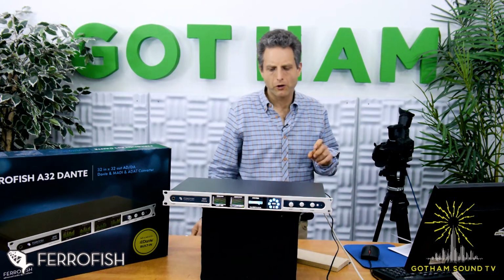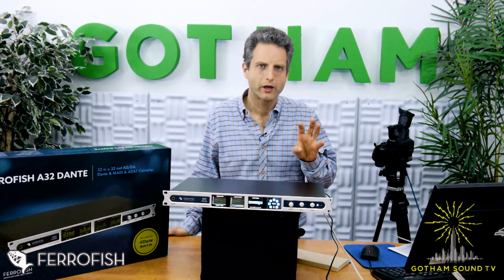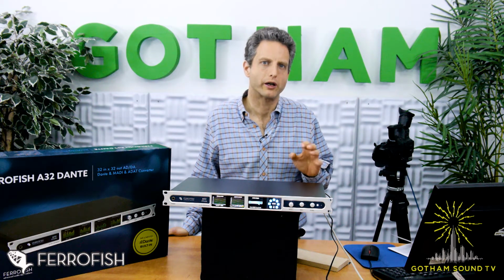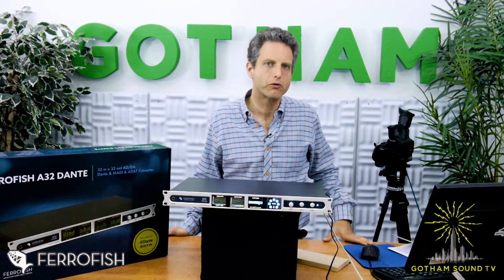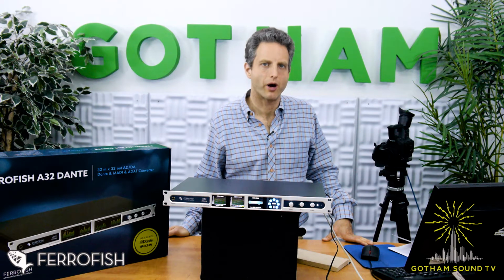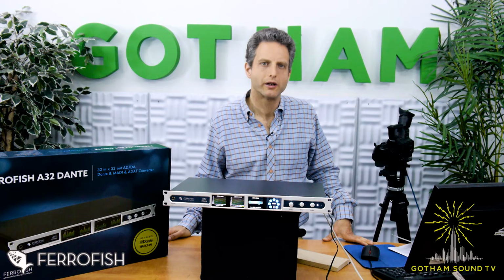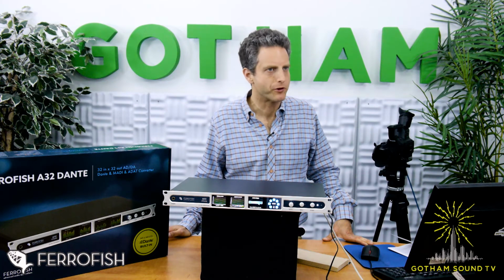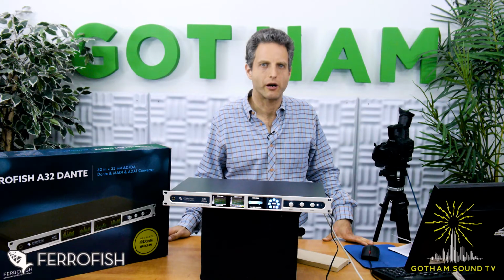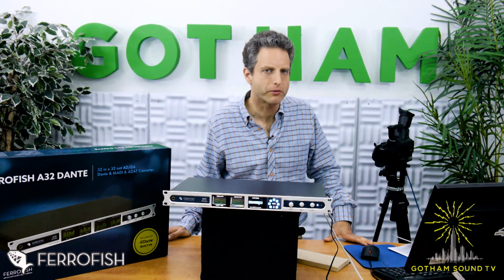So, all right, first of all, what is it? It is an A to D and D to A converter, 32 analog in, 32 analog out. It also can do Dante and MADI, both optical and coax, and also has built-in DSP, meaning that you can make a little mix, you can certainly monitor different inputs, and we'll get into some other future possibilities down the road with it.